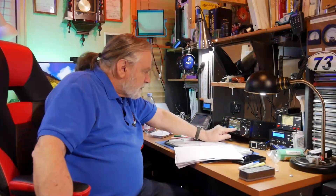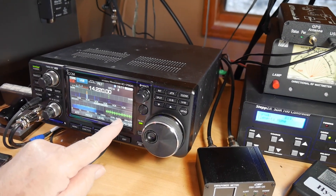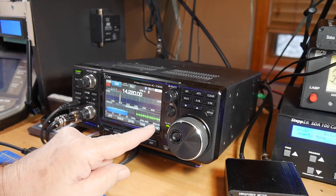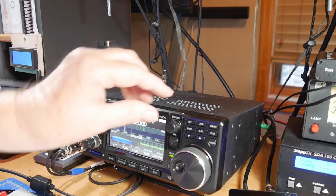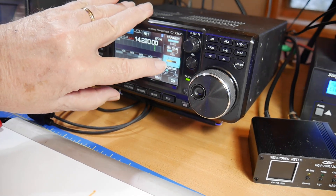He's saying he finds it hard to understand the relationship because of the RF gain, ALC, and using the audio scope on the ICOM 7300 to adjust and not overdrive the signal. Beware that the audio signal shown here is literally audio — it's the audio decoded by the radio, and it is also the first audio amplifier before the modulation. So it's not going to show any kind of disturbance. You need to set the audio gain correctly. If the audio gain is too high — here's the mic gain — I found about 44% is right.